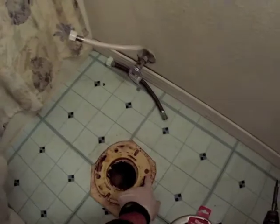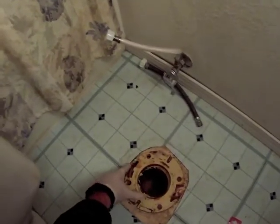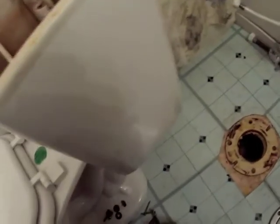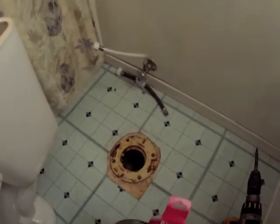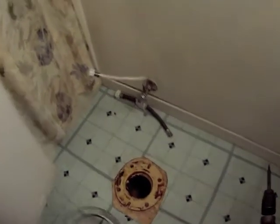Today we're going to repair a closet flange. This flange that the toilet bolts to is broken out here, and that side's cracked and ready to break. So when the bolts go in, there's no place to put them into. So Sioux Chief makes this stainless steel ring that we can screw down on top of this one.